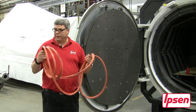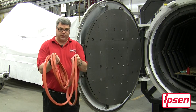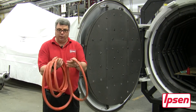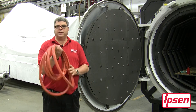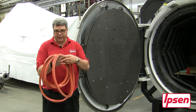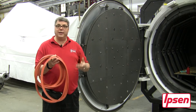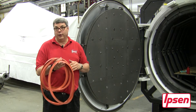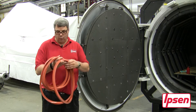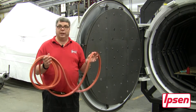When we take our new seal out of the box, there's going to be dust and shipping materials on it from sitting in storage — you can see it's a little off-color and dirty. This pertains to lip seals and/or o-rings: we need to take these seals and methodically clean them underneath, on the sides, and on the top with denatured alcohol or lacquer thinner, but we don't want to use acetone on the seal materials.